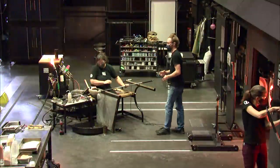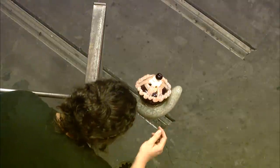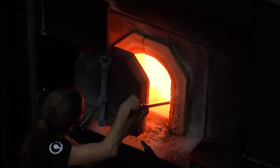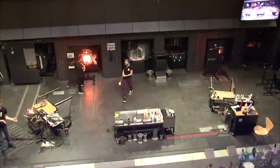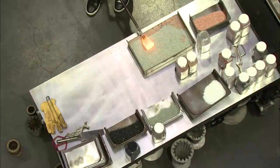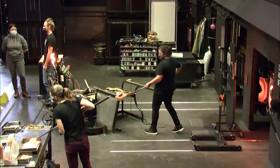So while we work in traditional glass making practices, we make a lot of vases, and we think about those objects. Those are all perfectly symmetrical, and while you turn, that weight is evenly distributed around the center axis. Now that we have this awkwardly shaped opossum and a pie on top of it, as you turn, you have these heavy sides and you have these light sides. And as you turn, you're kind of fighting the glass from falling one direction, and then you kind of have to fight to get it turned back up on top. So once you have something that's offset and off-centered like this, it becomes much more difficult to turn, and it becomes much more challenging and much more taxing on the arms, that's for sure.